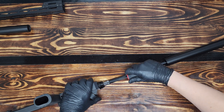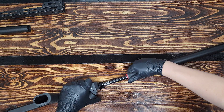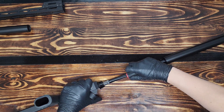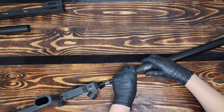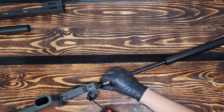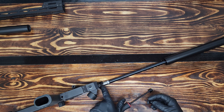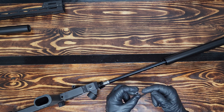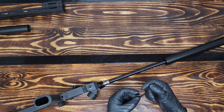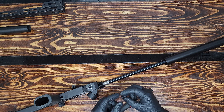Essentially, whenever it does work, you're going to take the tool, line up the pins, torque it free, and it's just going to come loose just like that. And there you go — there's the dynamic block valve housing. There is my spring seat and my spring that are still in the valve pin. I've got my o-ring inside there and my o-ring on the outside of the valve housing. Either one of those could cause leaks, so you may be getting into it to replace those.